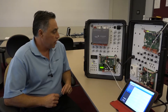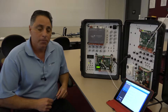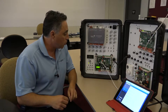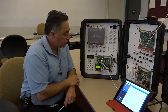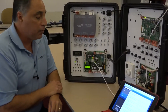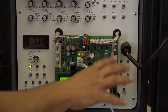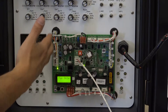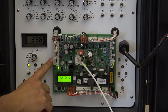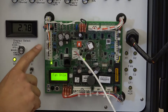Typically, a lot of the rooftops out there are going to be using a thermostat, and to do that it's fairly easy. So if you have one of these controllers, obviously in the rooftops, and basically on the Johnson Controls or York - one of our brands - you have this SSE controller. Within the SSE controller, you have a lot of different wiring here, and obviously this is a demo case here, but in the rooftop itself you will have your typical standard safety wiring preconfigured from the factory. Your thermostat input is always on the left-hand side, and based on our documentation, and there's labels right here - a silk screen on the board itself - that's going to give you the actual connection from the thermostat into the controller itself.